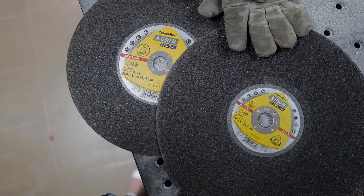Our main sellers for low powered chop saws are the A630N and A930N. The A630N, being three-thirty-seconds thick, is meant for speed cut — it cuts really fast. But you don't want to be cutting something greater than an inch thick, because it's not really meant for that. My rule of thumb: if it's three-quarter inch thick or less, or hollow pieces, the A630N is a great cutoff wheel.